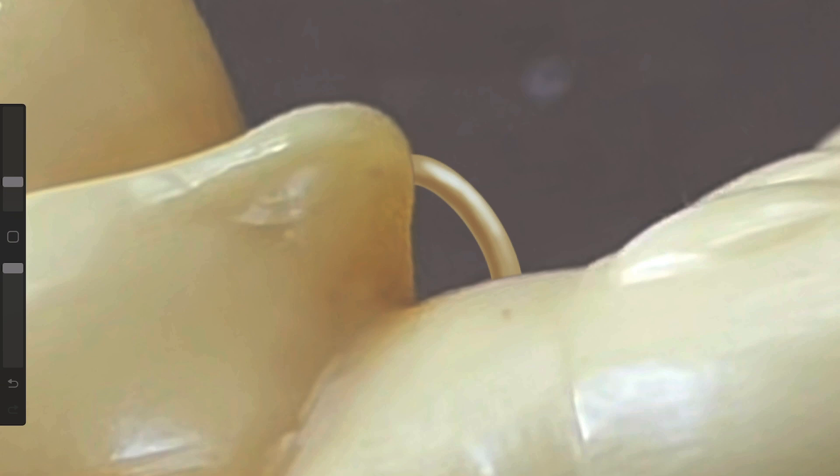It's a very minor cleanup job — just two little connection points to clean up on each casting. You have to remember it's there, because after you pull the body out from the cavity you've got to free that little vent by cutting through it just like this, and that way the entire casting will come clean out of the mold.